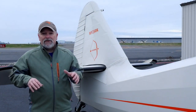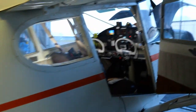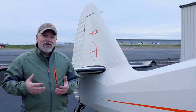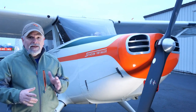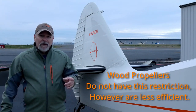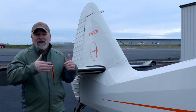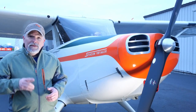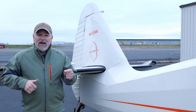All the flight control connections run on roller bearings, making them operate smooth and fluid. The nice thing about all models is how easily the rear seats come out in order to carry whatever you can cram through the door without going over gross weight. Strangely, after 70-some odd years, the Stinson 108s have only five ADs against the entire airframe. And if you're unfortunate enough to own the light case Franklin, that has a lone AD on it, and man is it a doozy. The only precaution on the propeller is the RPM restriction if you're running a metal prop — that restriction is between 2,100 and 2,300 RPM for continuous operation. Harmonics build up and travel back into the crankshaft, or it snaps just behind the front two cylinders, due to the lack of balance weights on the crankshaft. The piston, wrist pin, and connecting rods are all weight matched to the gram, eliminating the need for these counterbalances — that's why the Franklin runs so smooth.